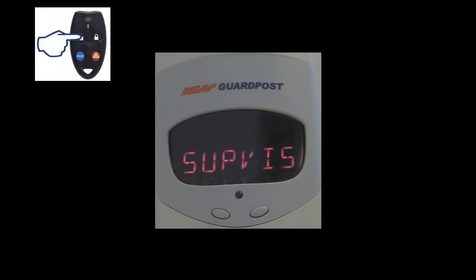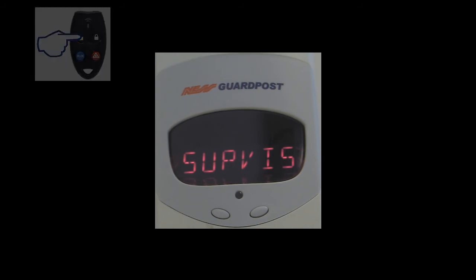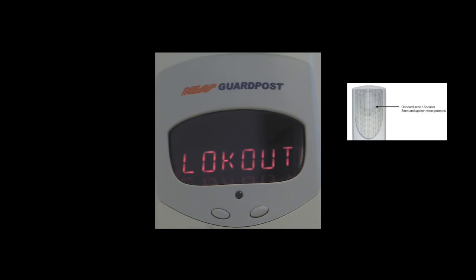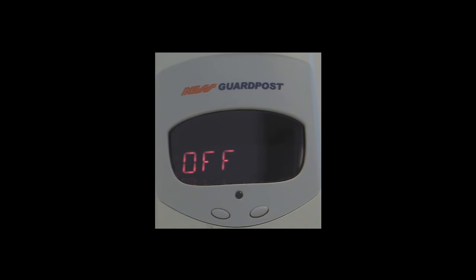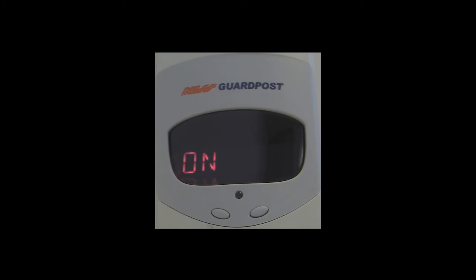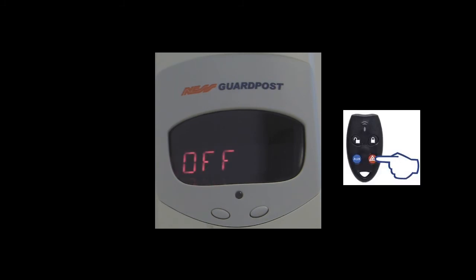Pressing the off button on the radio key takes us to the next option, which is Lockout, or alarm lockout. Alarm lockout prevents the sirens from sounding due to multiple activations from the same detection device. It should be noted that external sirens will only sound once on an activation until the system is disarmed and then armed again — this is to comply with many councils' or governments' regulations for noise on external sirens. What this alarm lockout feature does is control the security guard's internal or built-in siren. Pushing the on button takes you into the lockout option, and subsequent pushes cycle between on and off. Once you have selected the option, press and hold the panic button on a valid radio key to save your setting.